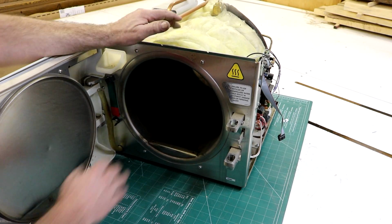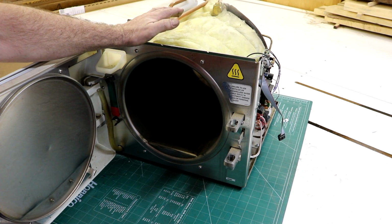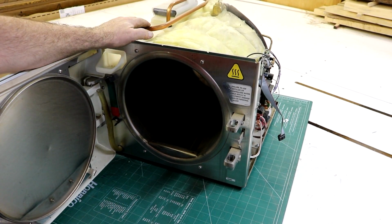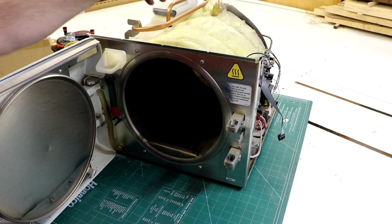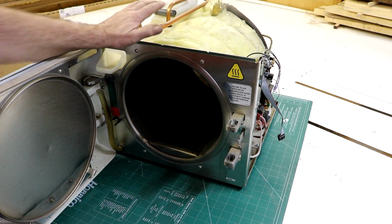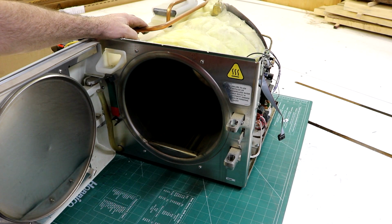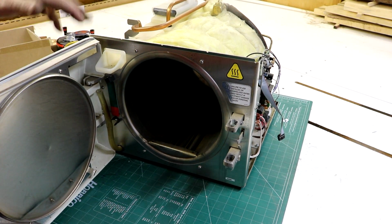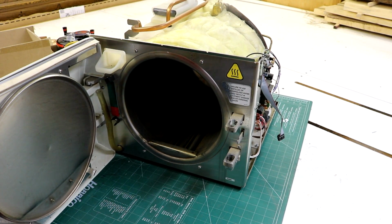All I'll have to do is shape some bricks and put in some high heat coils and a little bit of controls, and I'll strip off everything on the outside and insulate it, and then maybe build an enclosure around the outside. I think we can turn this into a nice little heat treat oven. I'd like to have a bigger one, but for now we'll do this bare bones and see what we come up with. It's nicely made. This thing's heavy. It's got a really nice door on it, and I think we can do this. So we're going to see what we get out of it.